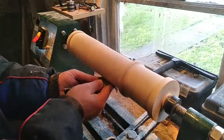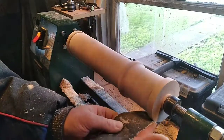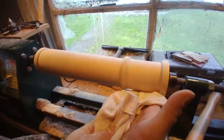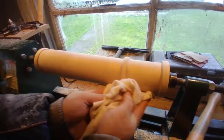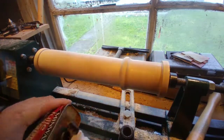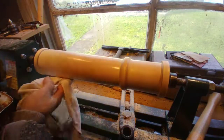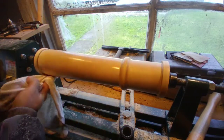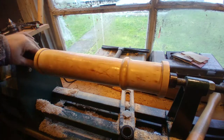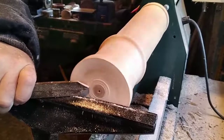Now I'm starting with a 60 grit. I wanted to start with 60 grit, something down quite low, so I can get the smoothest. Usually I start with 100 grit, but in some projects in the past I've been using the 60 grit, and it's been really helping out a lot. I'm going to use an antique oil to help bring that grain out and get it to pop some. I always wipe it down first after I'm done sanding. I did sand to 400 grit, and wiped it all off with a cloth and made sure all the dust was off of it. So now it's got the grain starting to look good.